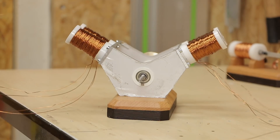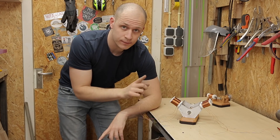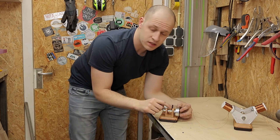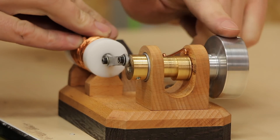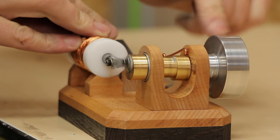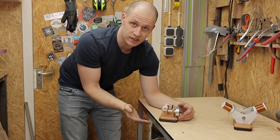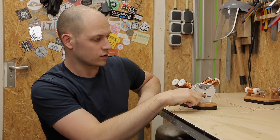Having the flywheel made, next up is the switching mechanism. For the switching I'm going to use the same mechanism as the previous one — sliding contacts that sometimes make contact and sometimes don't. When contact is made the solenoid switches on; when it breaks, the solenoid releases. You need one for each solenoid, so the difference is that on this one I need four — a nice row of sliding contacts.